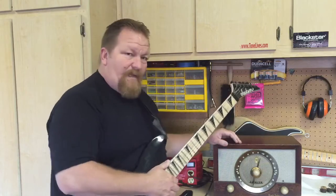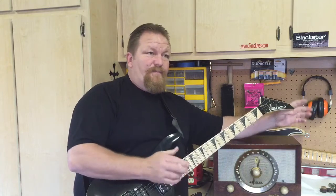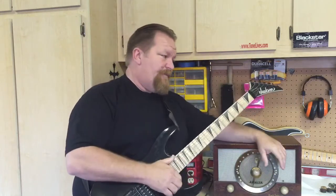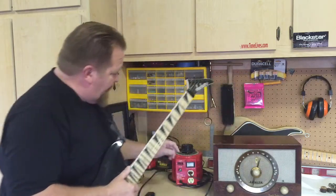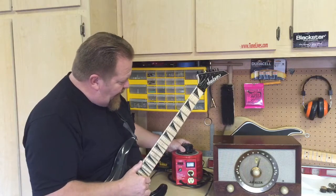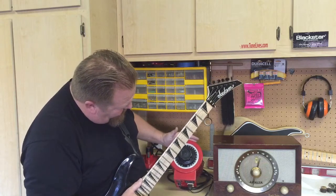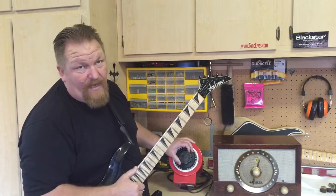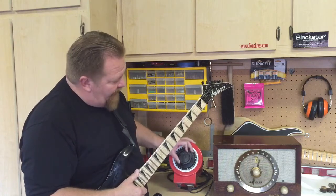But I just wanted to show you guys some stuff. I talked in my last video about a Variac, and there seem to be some real stories on what a Variac does. A Variac does not increase the voltage like a lot of people think. I have one here that I got off the internet years ago that's from China, and you can see on the top of this thing that it goes from 0 up to 130 volts. I can promise you that whatever the voltage is out of the wall is what this thing's going to put out. I've never got it to put out anything more than that, because that's just not what it does. It allows you to roll the voltage back.